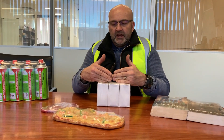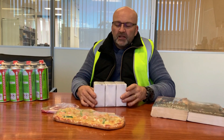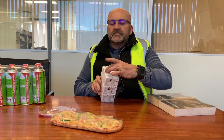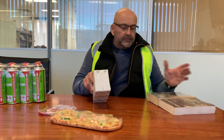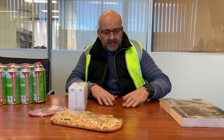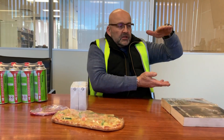We have done packs in the past where we've done say three tetra packs together. You'll generally notice the difference in packs — this one has what we call a bullet hole in it, while this is a complete seal. With polyolefin film, as the product is sealed inside the pack it's a total seal all the way around; as it goes through the tunnel it must balloon up and then shrink down. If you're not getting that effect, you're not going to get a good shrink.